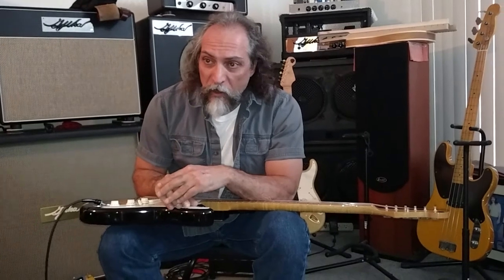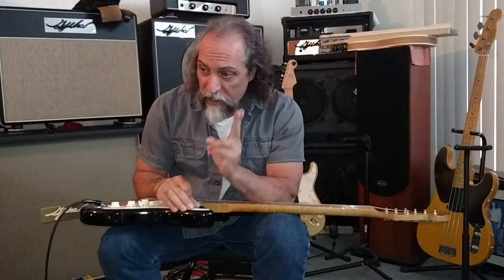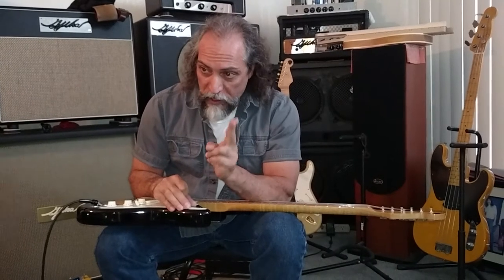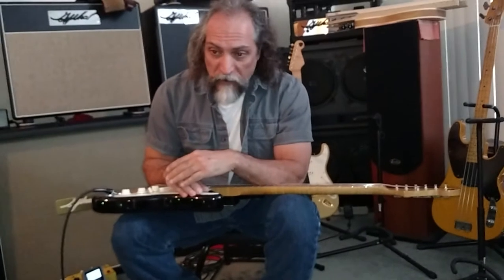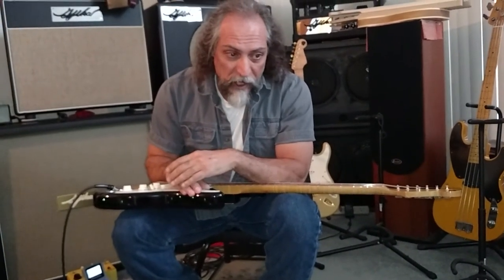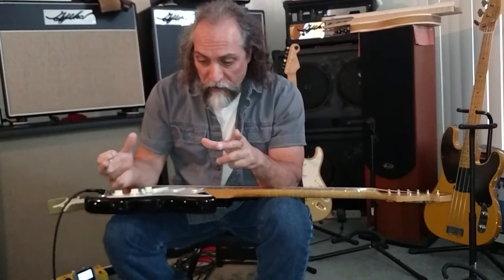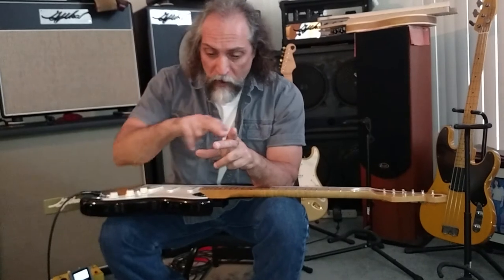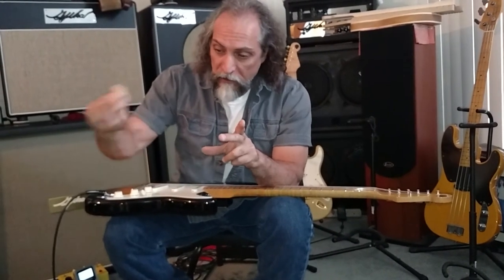It's just crazy. So everybody asks, why do I always use a Variac? Well, I suggest using a Variac for two reasons. One, it decouples the wall voltage. And number two, you can set your voltage for whatever you need. If you have an old amp, you want 110, 115, depending on how that primary is wound. Because if you know how transformers work, they transform voltages. Whatever that winding input is, there's a mathematical formula for the winding and the output voltages.